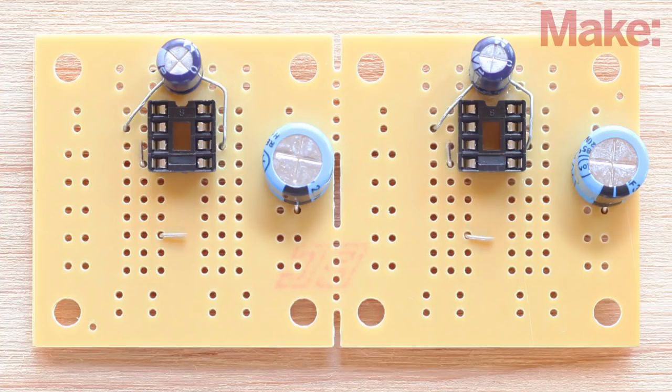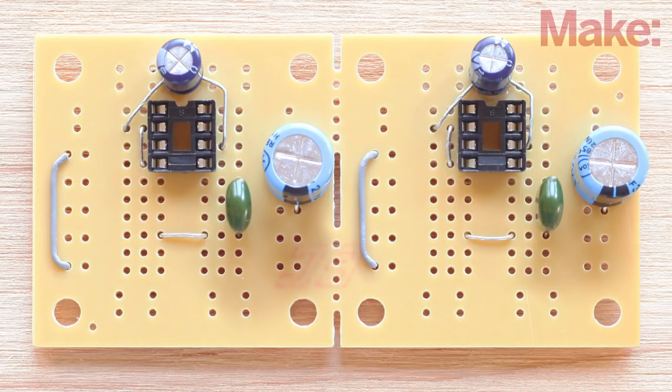The 100 microfarad capacitor will require a little creative wiring to fit properly around the socket. Next, we'll add jumper wires. The one on the left will need to be routed around the holes below it so we can add additional components later. Now we can solder a .047 microfarad and 33 picofarad capacitor to the circuit board. The finished board will be packed with components, so solder these caps a bit above the PCB surface. This allows them to be moved around to make room for the resistors that we'll be adding soon.